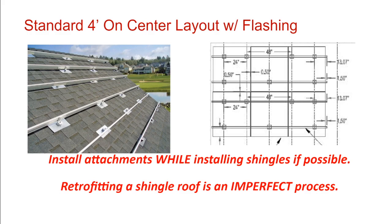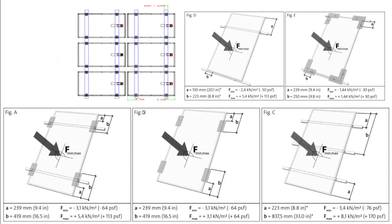And you do something very similar on utility scale ground mounts. You install your first solar panel, and then you screw in the end clips and prep the next clips, and then you install the next solar panel, and then you secure those clips, and then you add the next clips. Whether that's on the roof or on the ground, it's the same way. And again, we're going to come back to this probably on Thursday when we focus a little bit more on installation.